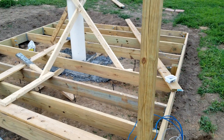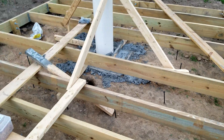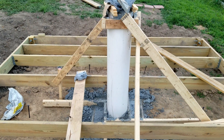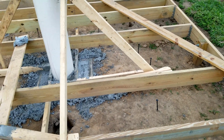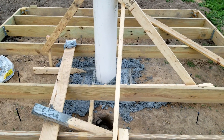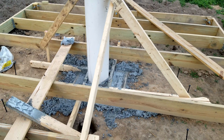I'm thinking about putting the sub panel on the pier but not completely certain yet. Mapped out the outer circle — 86 inches across for where the dome would be. That's about 43 inches from dead center, or 38 from the edge of the pier. Everything has been poured — concrete came on Saturday. The truck came in, delivered it, pretty easy — about five wheelbarrow fulls on top of the hole with rebar down the center.